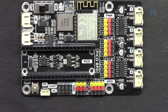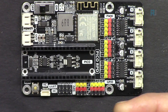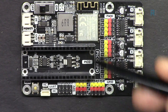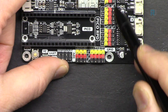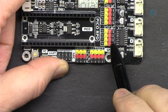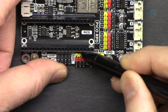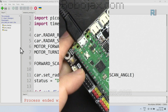Underneath this area we have the LM393, which drives the two LEDs for us. There is also a special I²C terminal for other modules that might be connected, though we are not using it in this course. This connector is for USB communication if you want to program the device. All black pins are ground; on one side the red pins are 3.3 volts, and on the other side the red pins are 5 volts. The chips near the motors are on the 5-volt side, and the other headers are 3.3 volts. Each pin is labeled so we can access all the GPIO pins of this module.